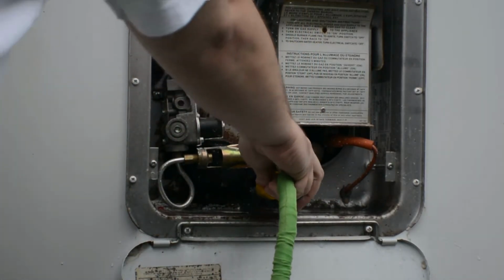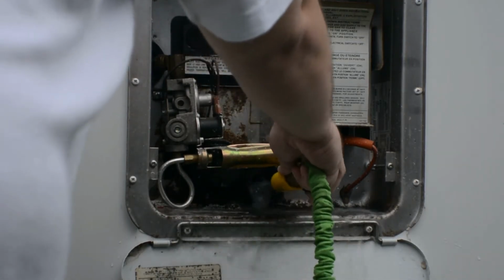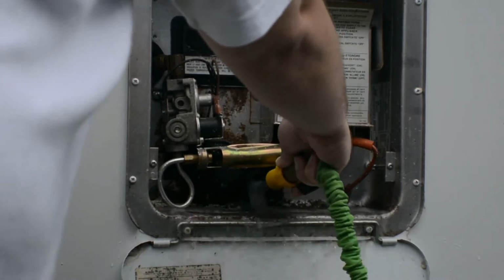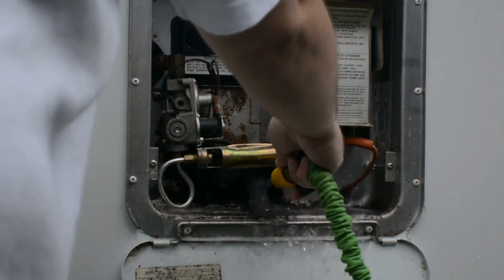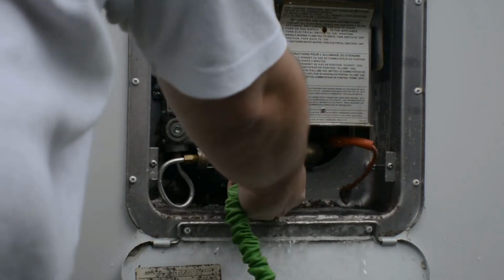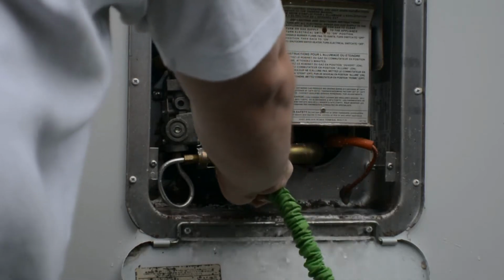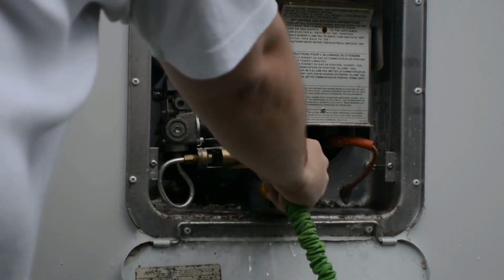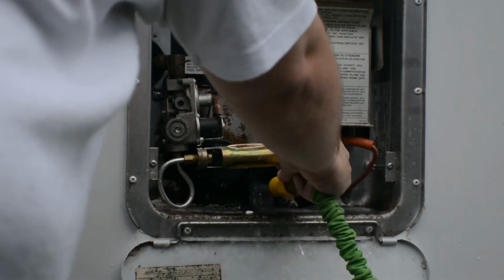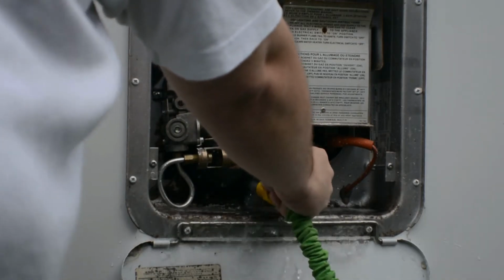Finally, you can see here where a lot of the debris is starting to clear out. You're starting to see a lot clearer water. Every now and then you'll see chunks where I've run the rod along the bottom, the rinser, in order to kind of help scrape off any bottom sediment. Also, I failed to mention, please turn off your propane tank and any electric that you may have going into the hot water heater. That way you don't have any way of getting shocked.